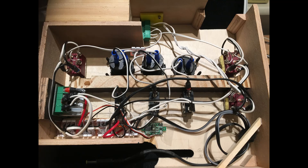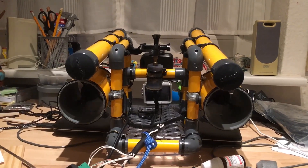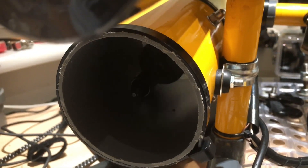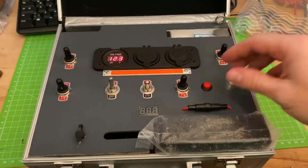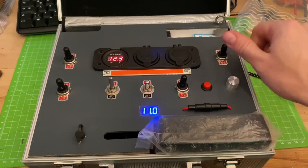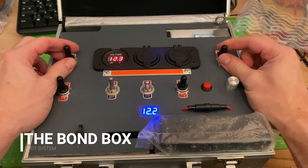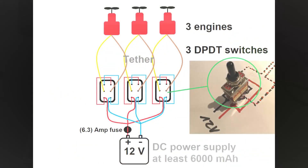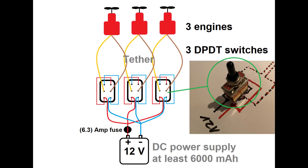I'm just here making sure more people can benefit from this free design. The principle behind wiring an ROV is straightforward: you have three engines and each one can do two things — going forward or backward. That gives six independent actions controllable by the operator. Each engine gets its own independent controller, allowing you to steer in three dimensions: up, down, left, right, forward, and reverse.